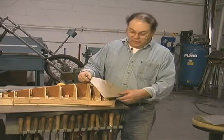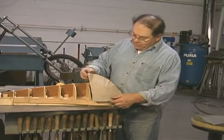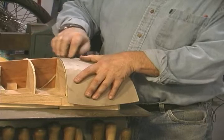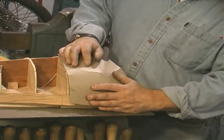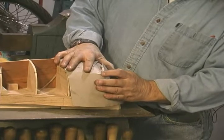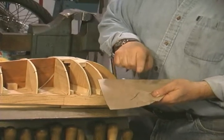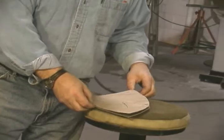This is my original template that I used earlier to decide the shape of the part I wanted. I want to draw a little more information from this piece — where I saw it wrinkling, I went ahead and cut it, and I'm going to lay it right on the buck where it belongs. It belongs right along the station here, with a point at the top that matches the length, follows down, and comes to its position at the bottom. Watch what happens when I push it down over the slit spots — I get a real high area here that pokes up. That's where it's hitting the highest point I have to shape. I'm going to transfer this line to the metal so I know the exact point to start hammering where the most shape is going to take place.